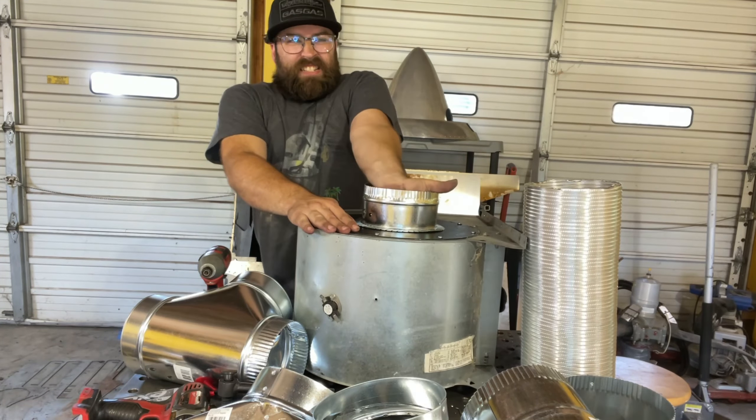Now that I've got it mounted, ready to hook up some plumbing and try and suck some stuff off this thing. So what I ended up doing is welding some angle iron to some square tubing to support the ductwork that I was attaching behind the plasma cutter. Put on the ducts with self-tappers and added a T. Ready to go.